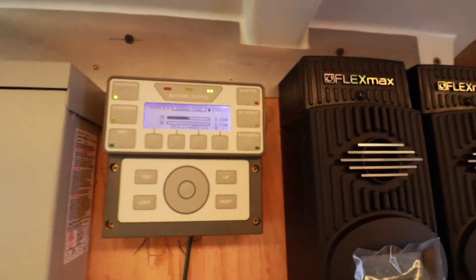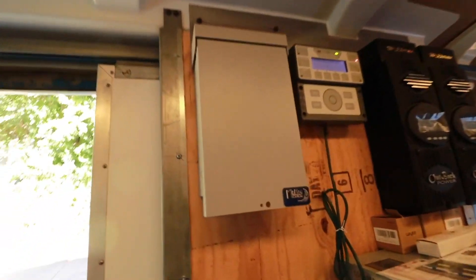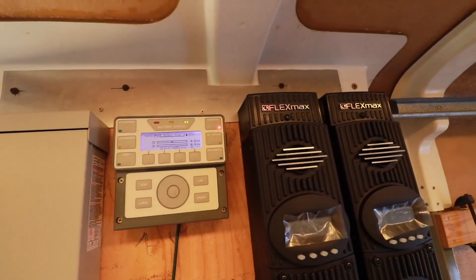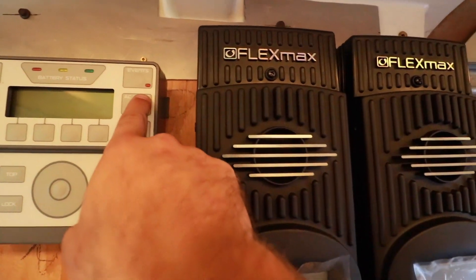There's an event lighting up here so we're going to have to check that out when we turn it on again. All it does is log the events that happened. There was an error in the charger and it logged on this battery status system — it's logging on this SD card here. It turns out I had my solar power on when we plugged it in, and that's what caused that. You can't have the solar on while it's charging. So that's something we already worked out. We're going to flick it back on and see what it says. Event log says: AC out, shorted error, battery voltage. I wonder if it's because you don't have your temperature sensor in? AC out, shorted error — so something shorted on your end. It's because you had your solar system on, and it usually throws that breaker. So I think we should try it again.